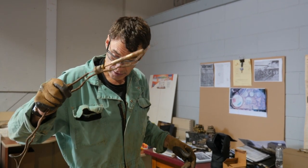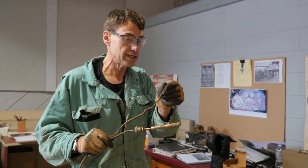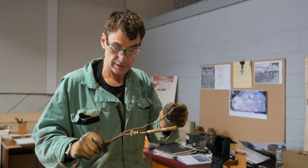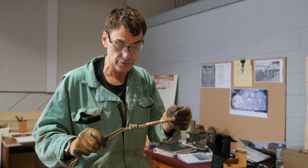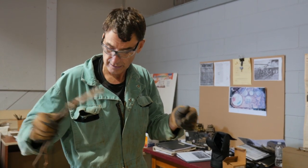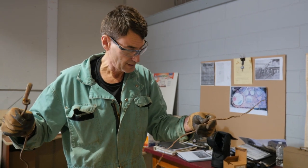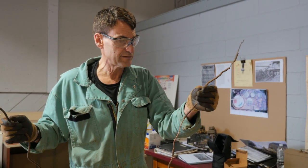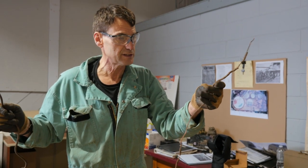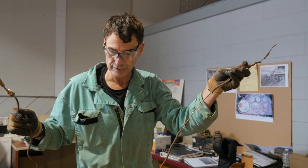It's an indication to the driver of what temperature the engine is running at. He wants to keep it around 90 to 95 degrees centigrade. Once he goes over 100, he's at boiling point and will start blowing hoses, etc. It's a copper capillary tube. We might be able to reuse it — it's broken now because the thermostat gauge itself is missing, but it's perhaps refillable with oil, and if we get the right size gauge again we might be able to hook it back up. That's something for the future. The rusty spiral metal coating on it was just protection around the thin copper tube inside through which the oil runs.